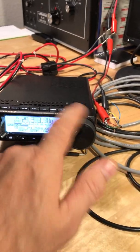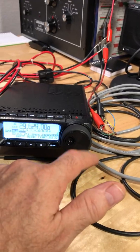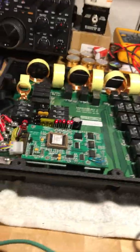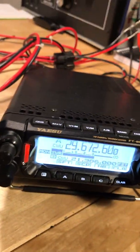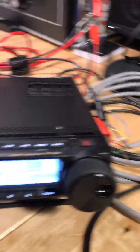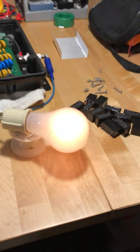The logic in this thing — I would have expected it to be much better. Maybe it's an old unit; I know the firmware date is 1995, which is pretty old, especially in 2020. Moving around the band — the bulb is getting brighter. It pulled something out of memory and came down to about 1.7-1.8 SWR. It must have had something in memory and it's happy with that — the bulb is reasonably bright for 25 watts into a 100-watt light bulb.